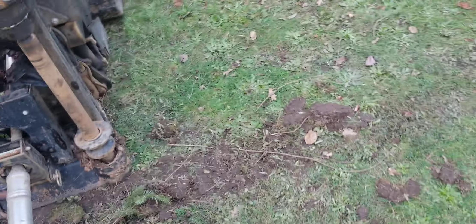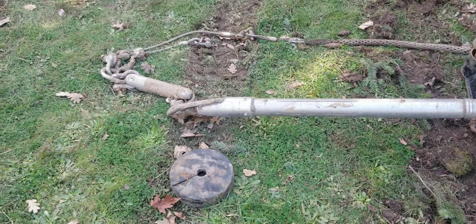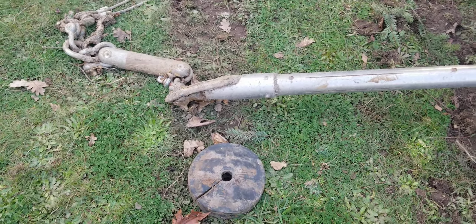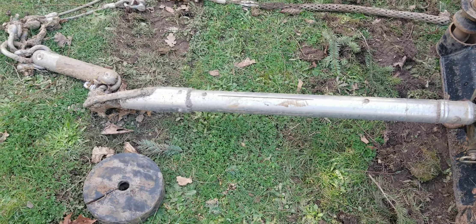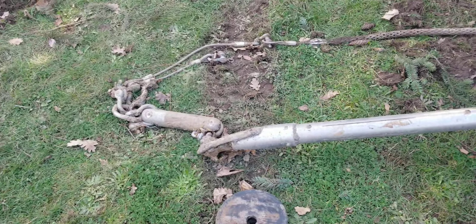The way you steer this thing is you get it lined up with the direction you want to go. The tip has an angled iron on it. As you turn the machine clockwise — you always turn clockwise so you don't unscrew in the ground — the rod spins, shooting water, basically cutting in a straight line.